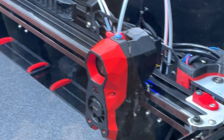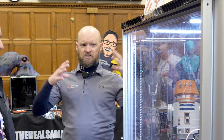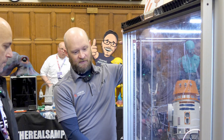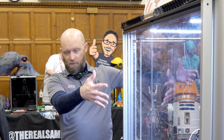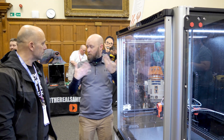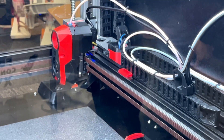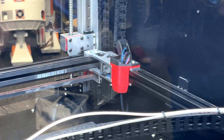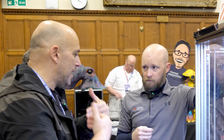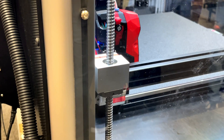In terms of kits, it's anyone's guess who will be offering them, because shipping this as one unified machine would cost several hundred dollars — the extrusions alone are very expensive to ship, and the back panel is over a meter in its longest dimension. Ideally, the better approach would be sub-assembly kits: rails, ball screws, extrusion, panels, and electronics sold separately so people can pick and choose. Someone with a CO2 laser could cut their own panels; someone with a CNC mill could machine their own parts, leveraging kit manufacturers' economies of scale only where needed.